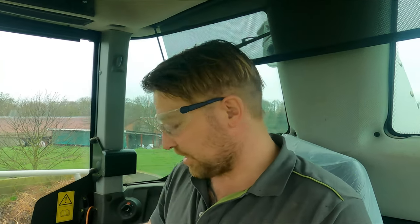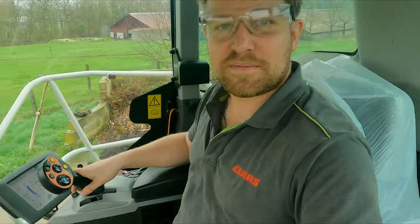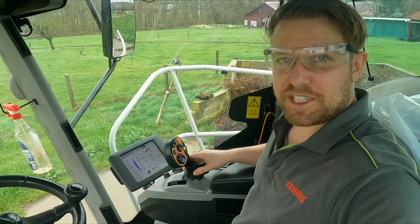The handbrake, we're gonna put the handbrake in, turn it off, turn it on. We're gonna make sure that the handbrake really is active, and that means we will also push the lever forwards with the handbrake activated and see what happens. We're gonna put it in neutral. We're gonna push the lever forward when it's in neutral. So if I gear one, neutral. Now we'll take the handbrake off. I've already tried it, that's why I'm so confident. And backwards. Not sure if you can see that, hang on. So it really does work, we're not buggering off. That's also how you'll get the air out of the hydraulics, by the way.